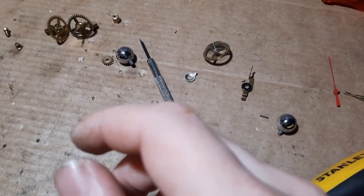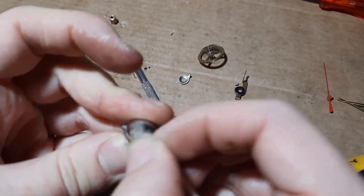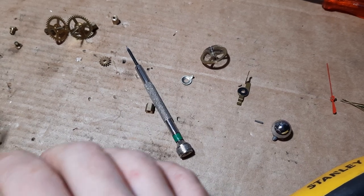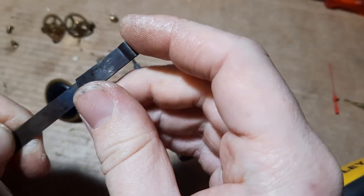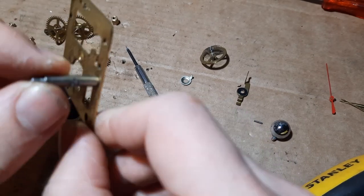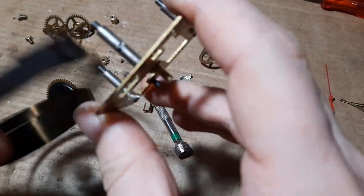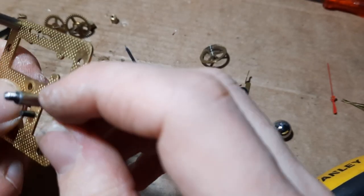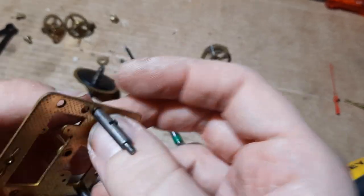I've cleaned the bits and noticed a few interesting things. First of all, I didn't clean these balls - I may as well. Also, the end of the mainspring has a date code: 6-7-1-2, so this is from December 1967. Secondly, there is an arbor notch in one of the pillars, and I think that's for stopping the spring sliding up - using the same machine they use for putting hooks in the middle of the arbors.